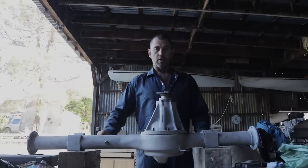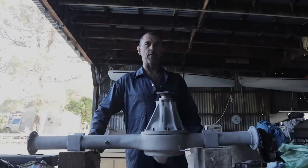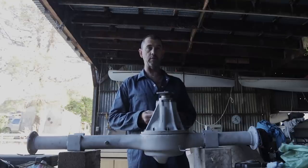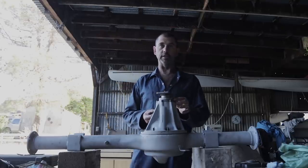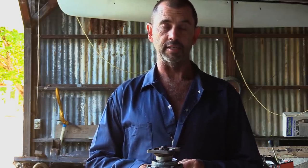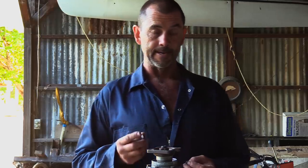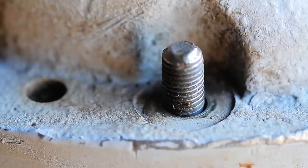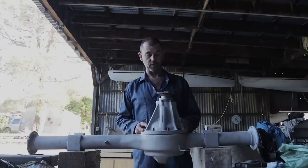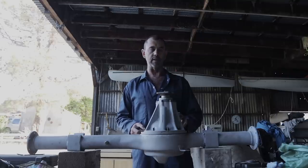So, I found with the fasteners for this Series 1, I've been having trouble finding new ones. Luckily I've saved all the old stuff and I've been reusing that for now. I was wondering why. From my research, and this is only very loose, taken with a pinch of salt of course, there's British standard and United States standard, and fine threads and coarse threads in both. So they're different. The ones that fit here have 20 threads per inch, where the 3/8 version here in the States is either a 16 or a 24, I believe, if memory serves me right.